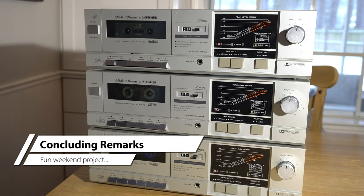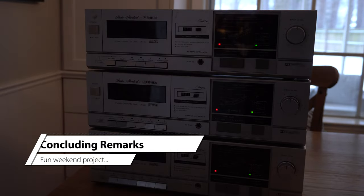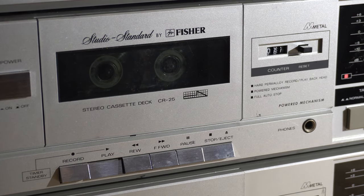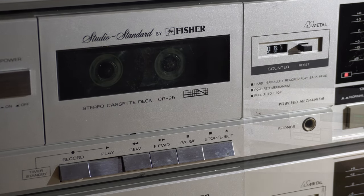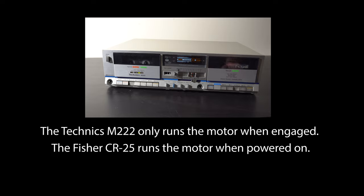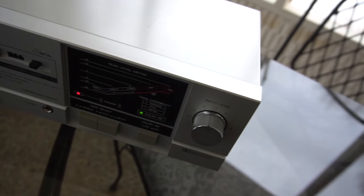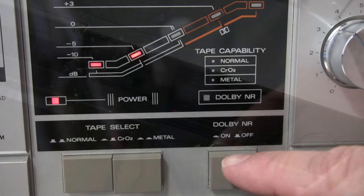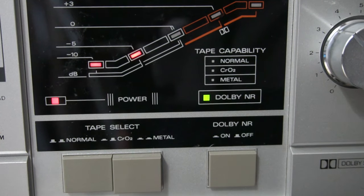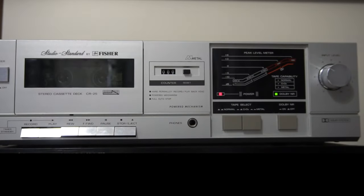That about wraps up the repair section of this deck. There's not a whole lot to say about these things. They're not the worst mechanism I've seen - they've got that mechanical soft-touch control. If you think of the Yamaha we did most recently, that is electronically driven. Something like the JVC is all mechanically driven - you're actually moving the heads. The Fisher has a lot in common with the Technics 222 model, which is a mechanical soft-touch control. But unfortunately that adds complexity - it adds belts. At the end of repairing the Technics, you get a nice dubbing deck with all these features and a cool meter. At the end of repairing the Fisher, you just sort of get an 'eh.' We'll close it out with some sound samples as usual. Thank you for watching this long experimental video. I hope you guys enjoyed it - see you next time for another awesome video.